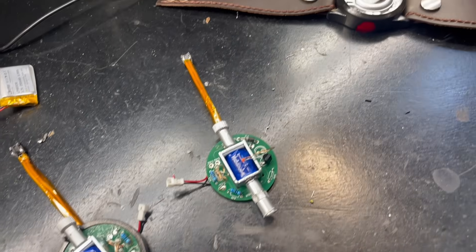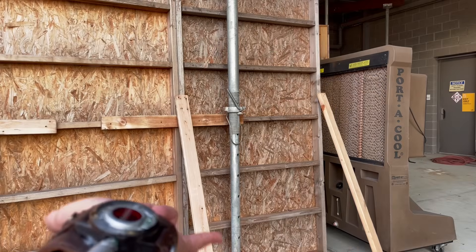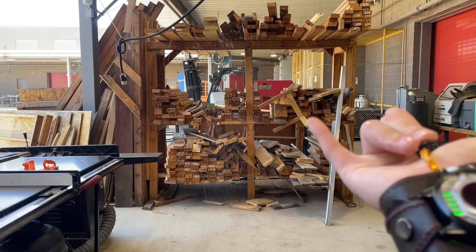So let's go over some final notes. Did I manage to accomplish all of the goals that I set out to at the beginning of the video? Given all of the individual components that went into this, I do believe I managed to get the design to be pretty compact. I also successfully incorporated electrically-triggered solenoid valves instead of mechanical ones and levers like I used to. It obviously shoots cool webs, so we're good there. And I do think that these perform better than all my other web shooters as well. First off, the capacity is higher, and it also uses the fluid much more efficiently. My last version was only good for about 3-5 shots, where this one — given that the cartridge has been filled properly — is good for up to 10. And though I haven't measured it specifically, I think I saw an increase in firing range as well.